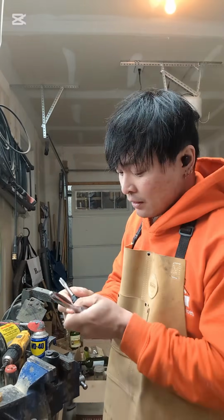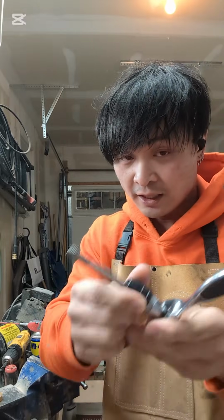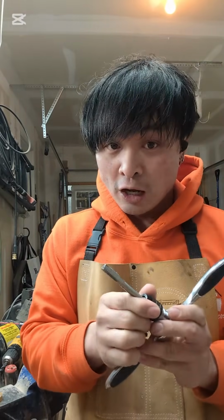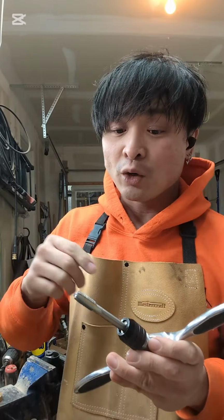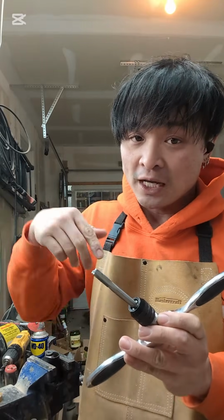And you go in with the M10. Now, if you realize that your die is not cutting thread, it's because your die, the thread maker, is actually dull. If it is, stop, do not keep using it. You can make a bigger hole and it's terrible. Get a new one or sharpen it. I don't know how to sharpen it, so I just buy a new one. It's easier, it's 10 bucks. So get a new one and just go on with it, okay?